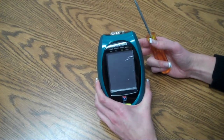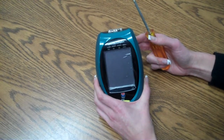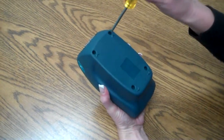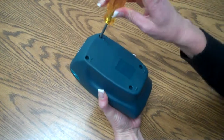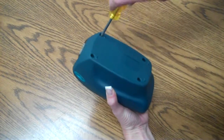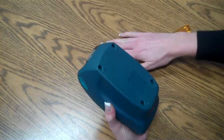This video is for taking apart the LanExpert to change the capacitor C606. First we need to take our screwdriver size 1 and unscrew all four screws. They should pop right out.